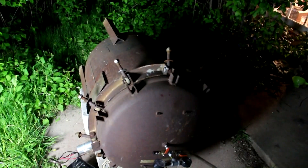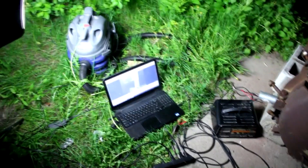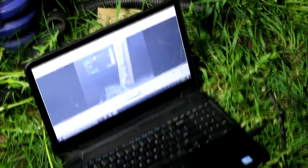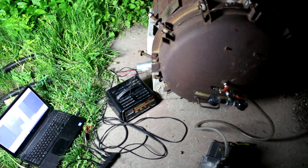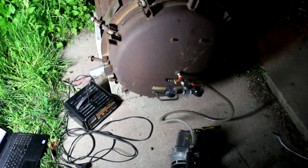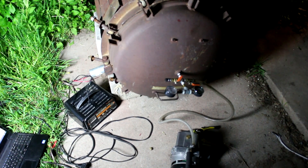It's a little while later and it's gotten dark on me. The vacuum level is now right about 25 inches of mercury relative pressure. The absolute pressure on the gauge inside the tank looks like 30 millimeters of mercury, so that means I've removed at least 95% of the air. I'm usually able to do better than that — maybe the gauge is tipped sideways, or the fact that I had to put this together on its side means I've got a leak somewhere. Anyway, let's turn the microwave on and see what happens.